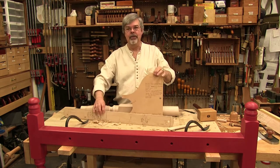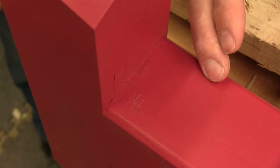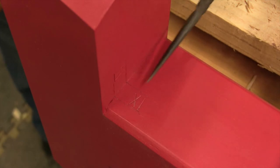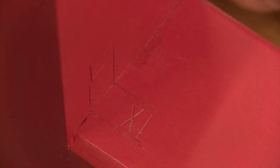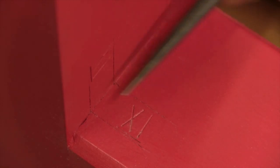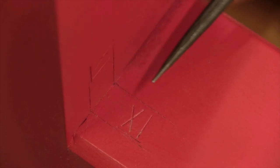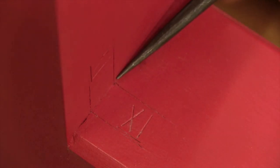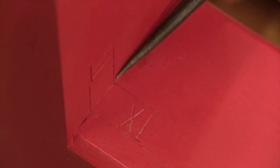I have everything I need from these patterns to make another copy of this bed. These beds come apart. On the Kenmore bed, the headboard and the foot piece are pegged together. On the Williamsburg bed, all the rails and posts come apart. To keep everything straight, they would be numbered — so this is number 11 and this is number 11. On the original bed, I looked at the evidence of the original makers and found on the rails these scribe lines right here. Those tell me where the mortise and where the tenons are — there's a tenon that sticks out from the rail into a mortise inside the post. The maker, and I also copied it, scribed up the side of the post. So this is the tenon and this marks the mortise.